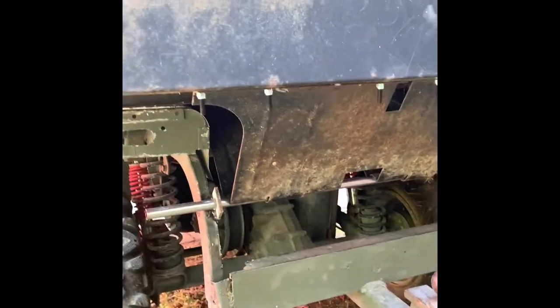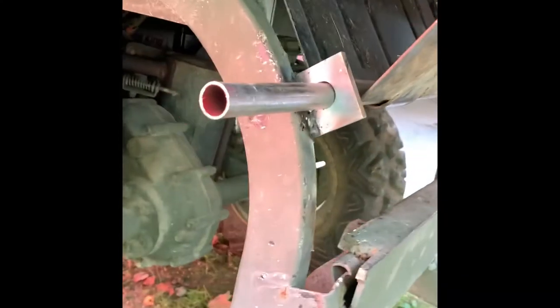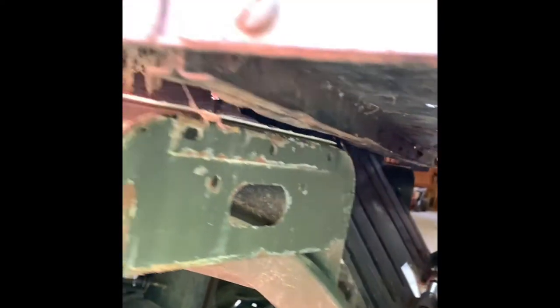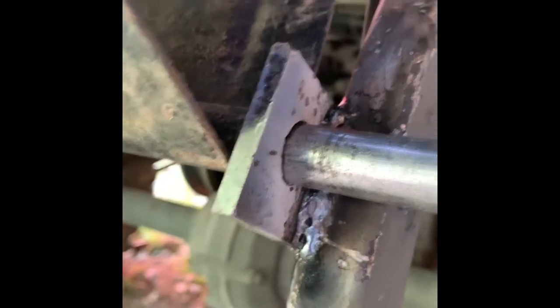I ended up sliding that bracket back a little bit farther just to get these ears a little bit closer. Everything came out pretty tight. Looks very nice. I got everything tacked in, so we just welded that ear on, and we welded this ear on. Basically just got it tacked. We still gotta grind all the square edges off those ears. That's a definite shin buster.